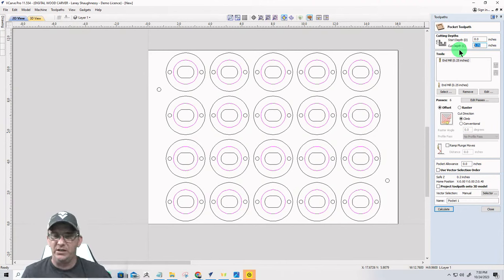So instead of going just straight up 0.1, I'm not going to go a full 0.125, you know, eighth of an inch or anything like that. But I am going to go 0.105. Or you could go 0.11, you know, 10 thousandths of an inch. I want to try to make it as flush as possible, but not too flush, right? So 0.105, just a nice little recess for myself.